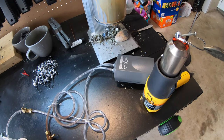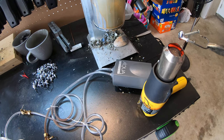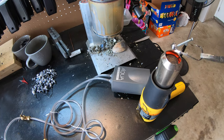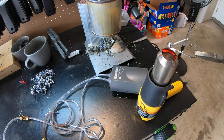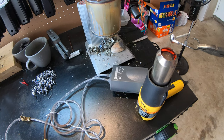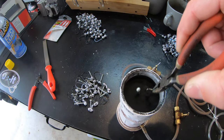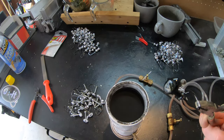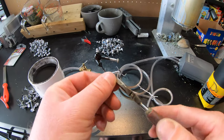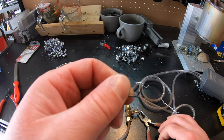This will be our last one on camera. A 20 to 25 count is pretty good on these jig heads, but it all depends on size - the bigger the head, the longer you have to get it hot; smaller means shorter time. You also have to play with the color you're using, because black seems to need it a little bit hotter than some of my other colors. Take that base hole pin out, just like that, and we've got one more done.